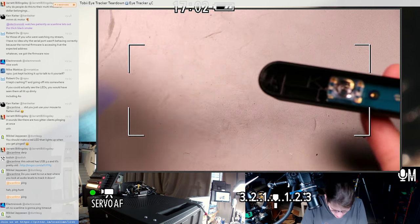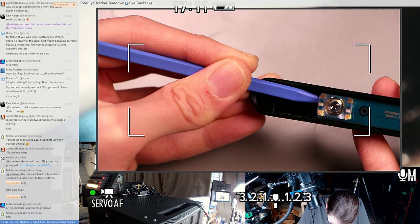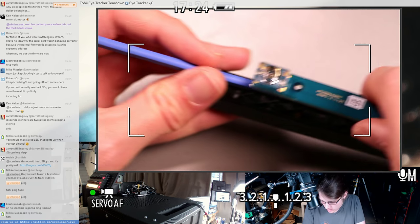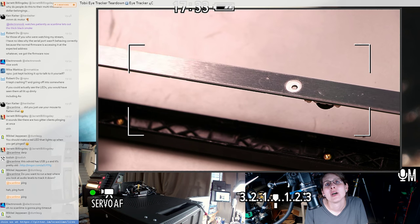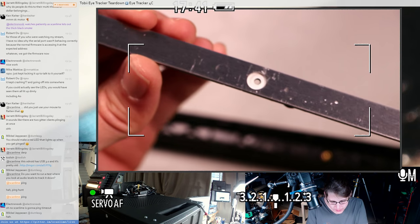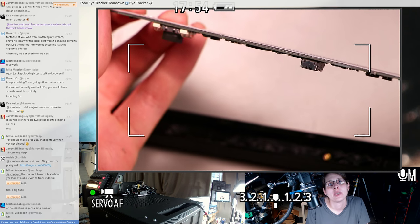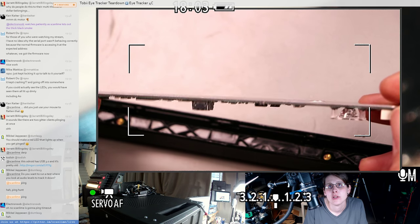I'm gonna try to get the other side evenly. Oh, I think that's a heat sink. You see that metal? Is this whole thing on a metal PCB? Oh, that's really nice. I don't think that's a metal PCB. I think it's a standard PCB, but they have this heat sink or heat spreader that's cut to fit the PCB and some kind of thermal pad in between the two, it looks like. That looks really nice. Also looks pretty easy to integrate into other things, since you could just stick it behind any old IR transparent surface, perhaps. And have the heatsink built in.